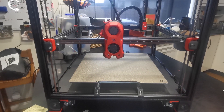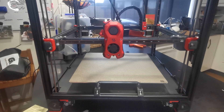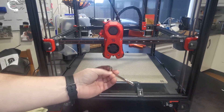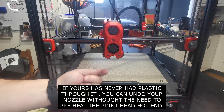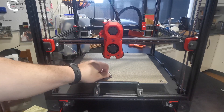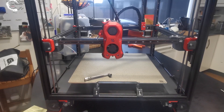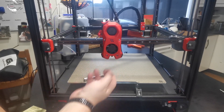If you're doing this for the first time, leave the nozzle out. If you've already put plastic through and are having problems, you'll need a socket — but don't undo the nozzle until it's at temperature. Otherwise you can potentially cross-thread it going in, or snap it coming out because the plastic locks it in. For a first-time e-step calibration on the Voron, leave the nozzle out and put it back in once calibration is done.